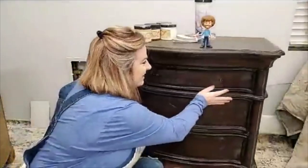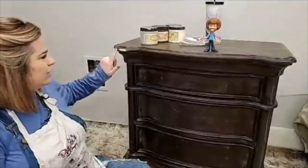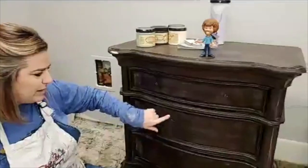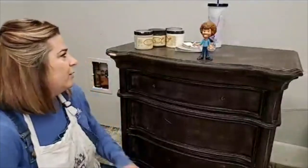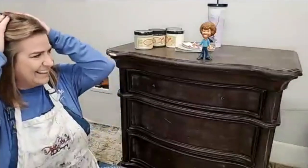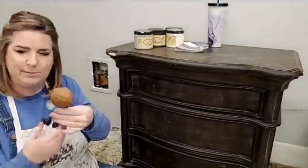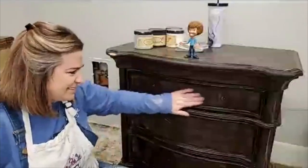On this piece you can already see that I've taken my gloss down. I've got some marks here — I didn't go down to the wood. This is a spot where I had a little nick, so I took that down level with the surface. Had another one here, so I made sure I sanded that out. I'm doing little tiny repairs at the same time to get my surface ready for paint.